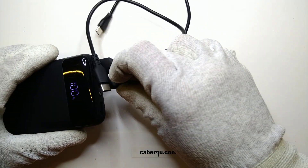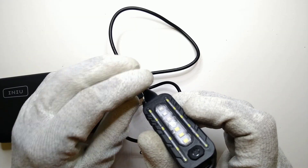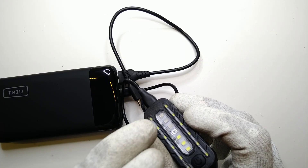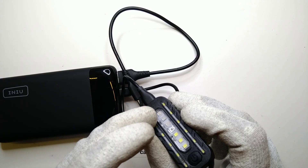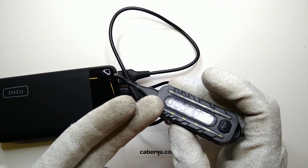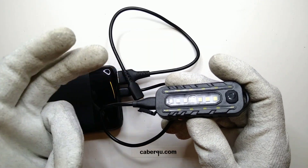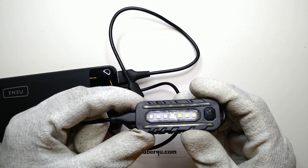Now let's take a look — it's still the same power bank, but just a different cable. The USB-C to USB-C cable, if I connect it, doesn't do anything. There is no light going on and the power bank itself will also go out after a while because it didn't detect anything being connected. That's due to the fact that this USB-C port is missing the pull-down resistors, or if it had been produced with a bit more future-proofing in mind, the IC that actually does the power negotiation. But for simple devices like this, the pull-down resistors would be perfectly fine — and like I said, they are below a cent, so they don't even matter. It's just a problem with designing those little gadgets.